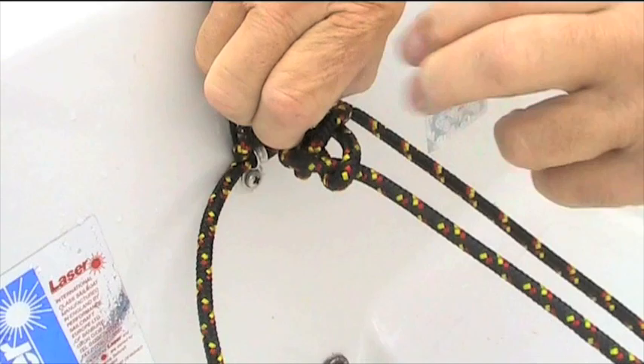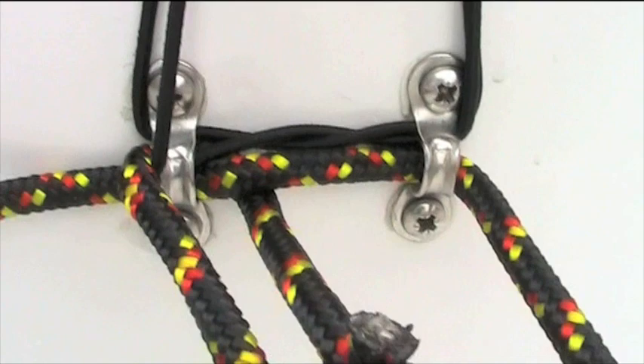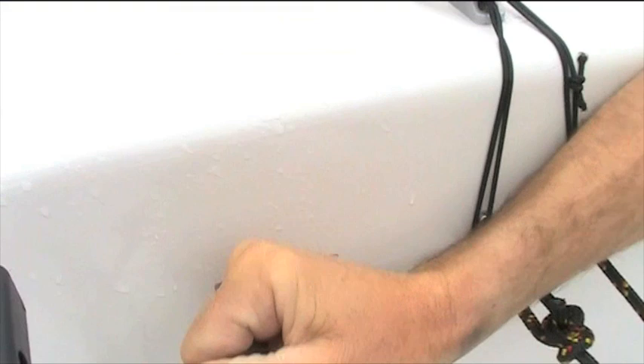It's not just going to tie a bowline on top of that rope — it's going to tie a bowline behind that rope. So effectively, that's where the bowline's going to be. When that one's tight, you'll see that the bowline is pulling this line into the back of the deck eye, so it grabs it. You can make it tight no matter how long or short the toe strap is — you can pull it as tight as you want and it grabs it. This is why we use thick rope, because it really does grab that rope nicely.